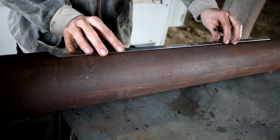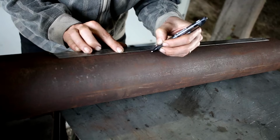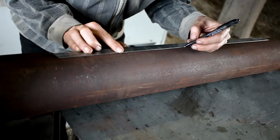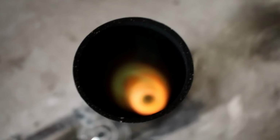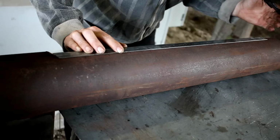Now, secondary air intake. I'm putting a hole every 50 mils because counting in units of 5 is really easy for me. Don't judge me. Just been looking at some of the old footage that I took, and in some cases, the vortex and the fire had swirled, you know, almost a couple of inches from the top, which tells me that there's still obviously a fair bit of heat and combustion going on in the riser.